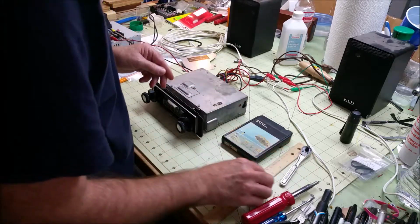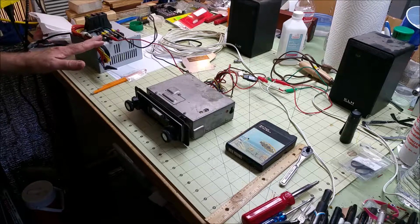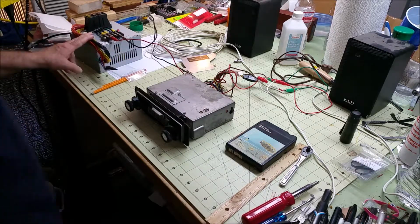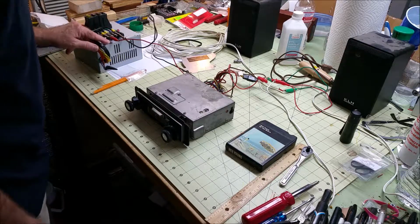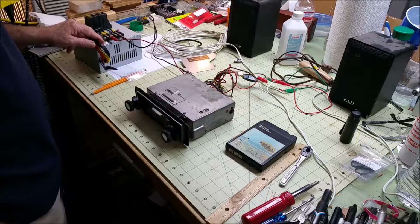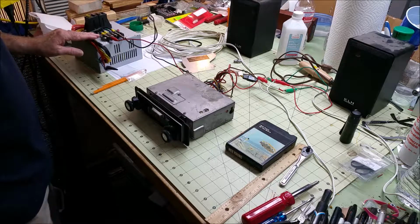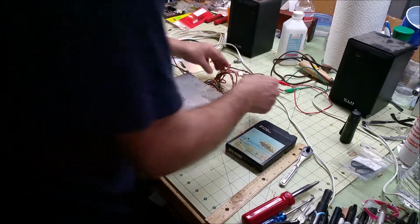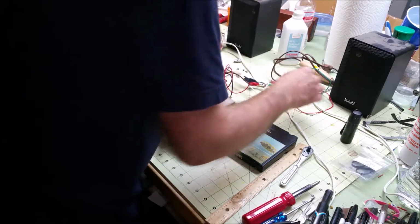Now we'll play it and see what it sounds like. You notice I have this hookup for electrical, and this is an old computer power supply, probably from an early AT computer. I can get 3 voltages from it, 12, 5, and 3.3. And I added fuses to it. These are very handy for doing projects like this. So I just hook it together with alligator clips, making sure I'm not shorted out anywhere. It becomes a bundle of snakes here pretty quickly.